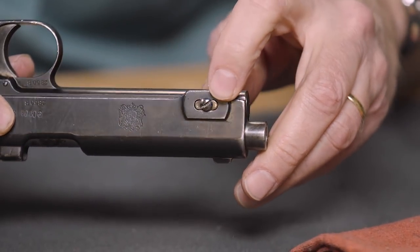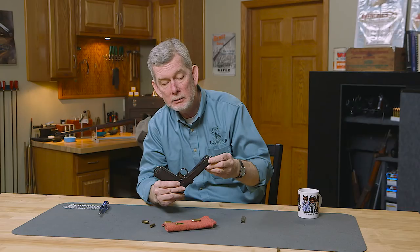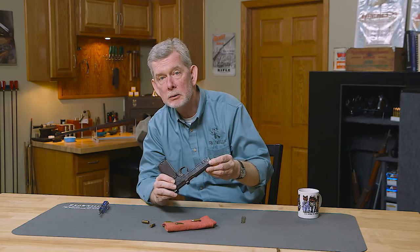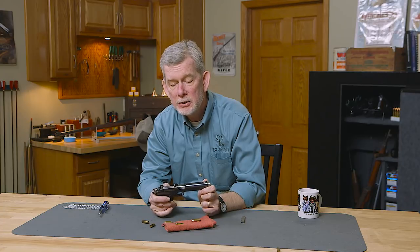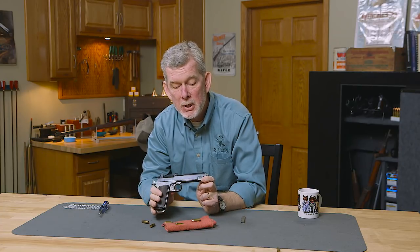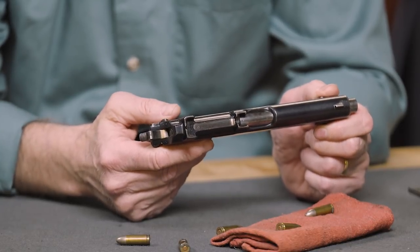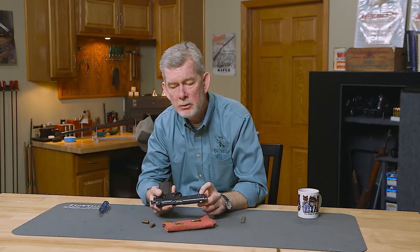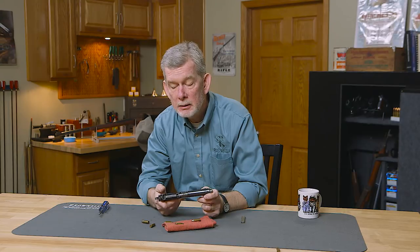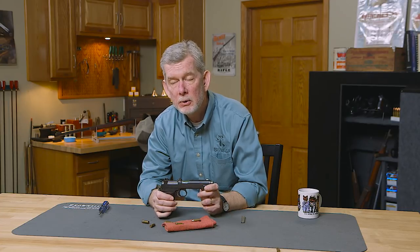You guys that already know about the Steyr-Hahn, you know there's no screw that belongs here. Well, this was my first gunsmith project in metal. I went to an old gunsmith back in Greenville, Mississippi, with this gun that I bought for $99 missing some parts. I said I need to find a wedge, and there's none available in any of the catalogs. He said, well, you got to make one. He gave me a piece of metal and a file and sent me home and said, just file and fit and file and fit. When you're done, bring it back and I'll finish it for you. So I filed that wedge, got the oval nice and symmetric, even bearing. He took it in his drill press and drilled and tapped a hole in it, put that screw in it, and fire-blued it right on the spot. I was in awe of this guy — it was like he was doing magic. He was an old amateur gunsmith and a retired florist, great guy.